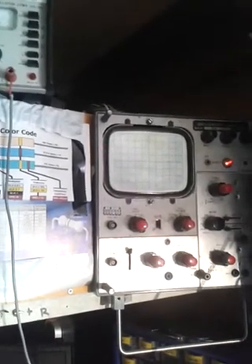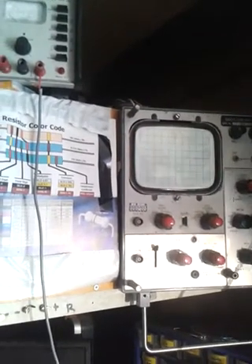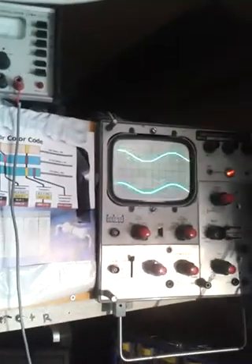Hopefully you can hear and I can feel the increased bass output of the speaker. You can also see that the traces are now completely out of phase — 180 degrees. And if I put it quickly back down to zero, you should hear the bass drop — and that's back down to in phase, no bass.